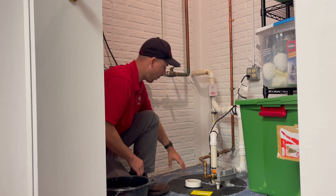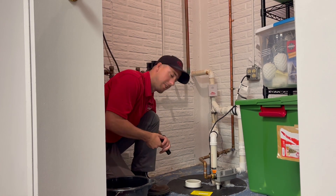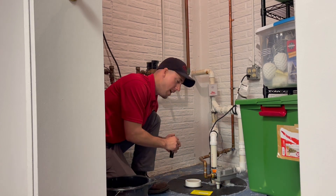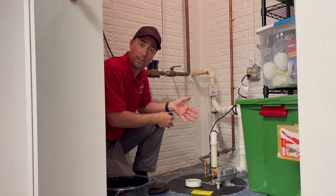What we do in all of our installs is on your sump cover, you'll actually see there's a little window here. What you can do is take a flashlight and look inside of there and you can see the water level. That just tells you, in general, is the water level up higher than it should be? Is there water in there?